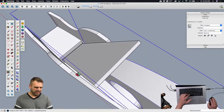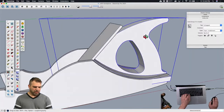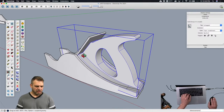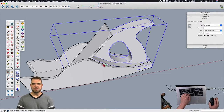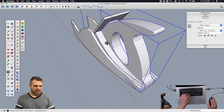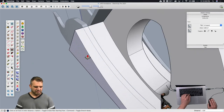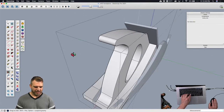This is one of the things that makes infill planes a little bit unique, and that some people think they prefer, is that you have all of this support for the plane, which hopefully reduces chatter and makes them more stable for dealing with squirrely grain. Some good nomenclature there. Now, you'll have people who argue that a well set up regular plane works just as fine. So it's sort of not a Ford Chevy thing, you know. Just to be clear, it's not hard science, depending on who you ask.